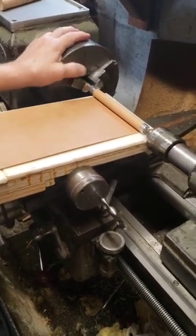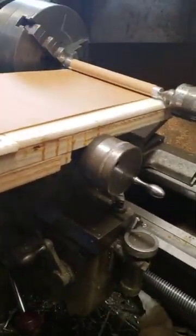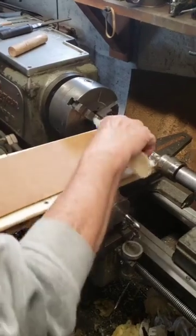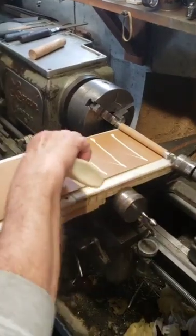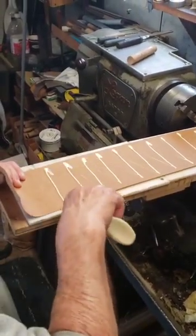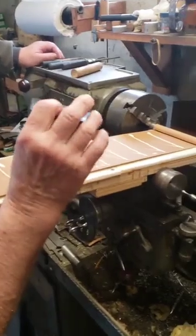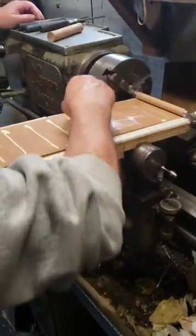I pull it nice and tight, then I back it up. Now you can see the former underneath there. Put it in gear. Now I hope this goes on okay — it's not warmed up at all. I've got a little rubber spatula here, quarter-inch thick rubber. I don't know the name of it, but that's what I spread my glue on with. That probably takes the most time because you've got to work it into the paper. I've got to have enough time as I'm rolling it before it tacks up.